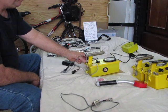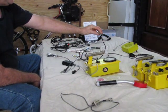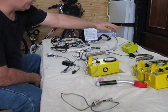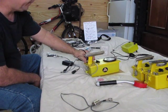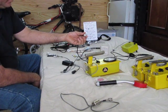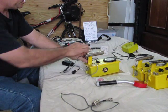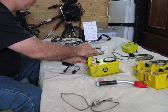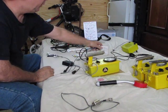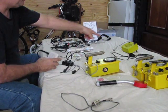The audio port on the CDV was originally a Switchcraft 2501F. You can still find these, but they're harder to find and more expensive than simply going to Radio Shack and buying a PL259 antenna connector. It has the same shell diameter and threads, but the center pin has to be cut down a bit so it'll fit. Once done, you can make a patch cable to go into a battery-powered speaker and not have to use the original headphones.